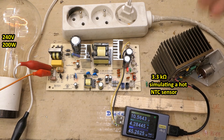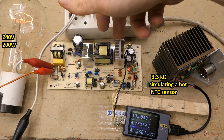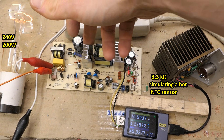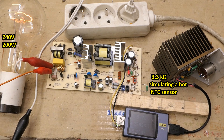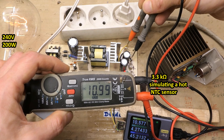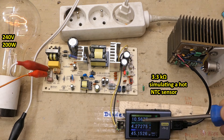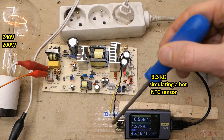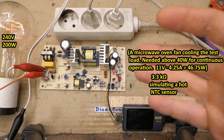It cools better with the components oriented vertically. It seems to be working. The diode is warm, the transistor is just slightly warm. It's always a brilliant idea to touch a live heat sink, isn't it? The voltage on the terminals is still 10.99 volts — slightly lower at the port due to wire resistance. Using a crappy USB port to connect it — it seems to be working well.